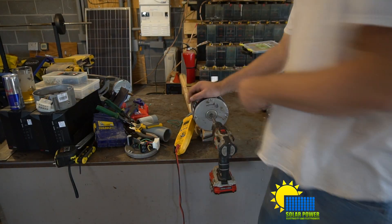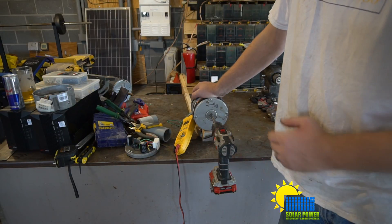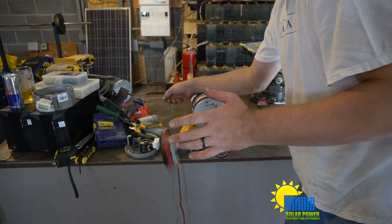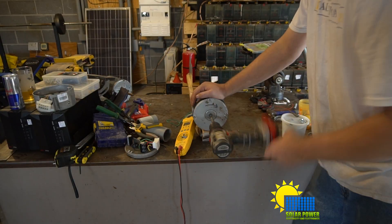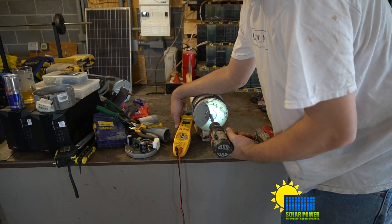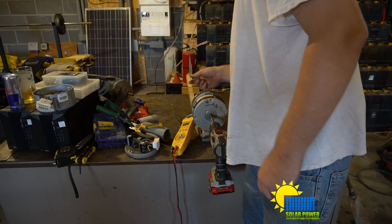If I short circuit the other two wires, it gives twice as much cogging. If I short circuit all three of them together, all the windings would be short circuited, and that would act as a brake, because this is a three-phase motor. Right now it's short circuited and you can see the cogging effect. If I disconnect one of the wires, you can see how quickly it turns. Let's stick it back in — short circuited again. Now we're going to pull the trigger and watch the amps. Short circuit current: 2.48 amps. That is a good amount of amperage — 2.5 amps for one short-circuited circuit, and we've got three circuits we can pull power from.